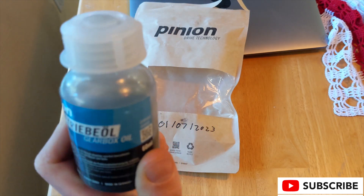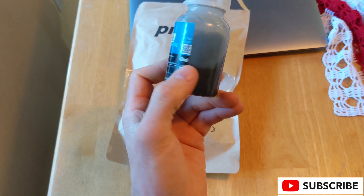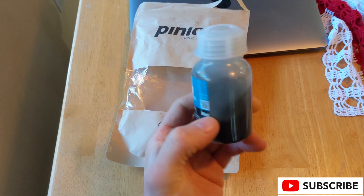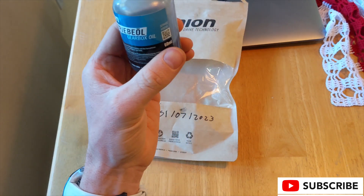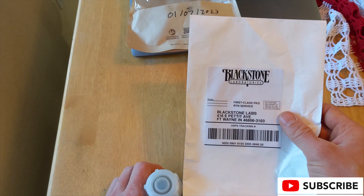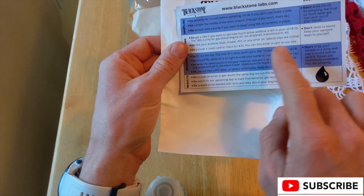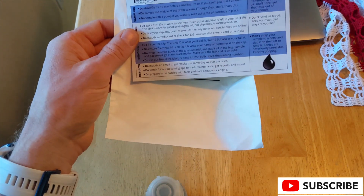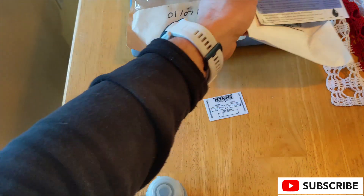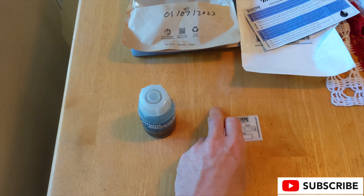This oil is way overpriced for what it is. The lab testing shows that, and I think this is really going to help folks who have this gearbox do a lot more oil changes, which will be better for your gearbox long term. If you're changing your oil once per year and using the gearbox heavily in sandy or wet environments, it'll probably test worse than mine, have even more metal in it, and won't last as long. These gearboxes are warranted for five years; if you change the oil once a year, I'm actually going to move toward quarterly.